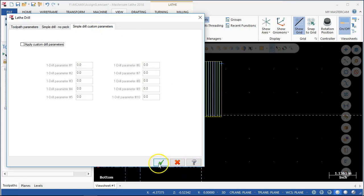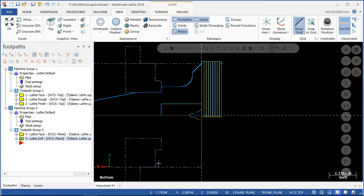No custom parameters. It shows me the drill geometry — going in with a half inch drill. Maybe if it was an insert spade drill, something that can take that kind of load — standard high-speed steel drill, probably not. You know, if I needed to peck it, but it would still come back to at least having a pilot hole to remove some of that material. So going with another drill — we have enough stations.